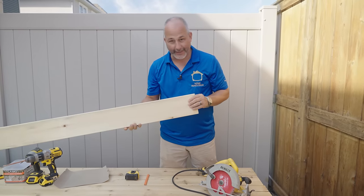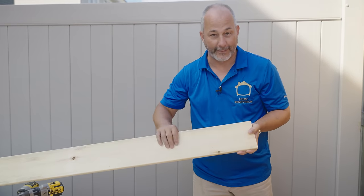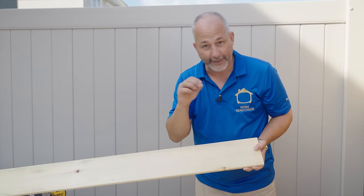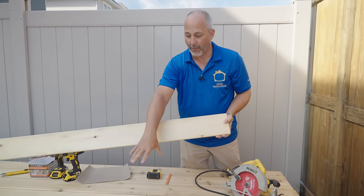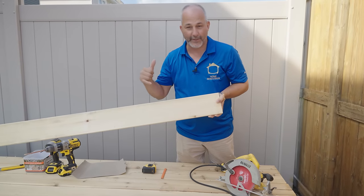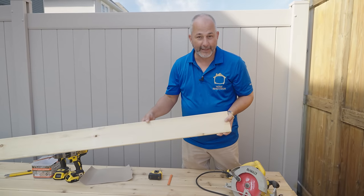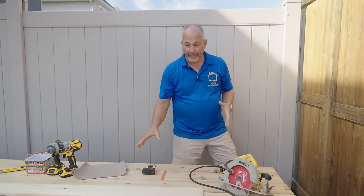This is select cedar. And if you go to a nicer store than the box store, you'll be able to order this. They'll have it in stock. This is a 1x6 select. It's a higher quality than the fence board, right? So basically, it's not clear cedar, so it still has a few knots, so it'll mimic what you see on the floor, but it's the same quality as what's on the decking board. And this is the kind of product you want to use for anything that's horizontal, like a fence or a bench, all right? So don't just go buy fence boards. They're super thin, they're super flimsy, and they're super cheap, and they're not as good a grade, and it won't stain as good.